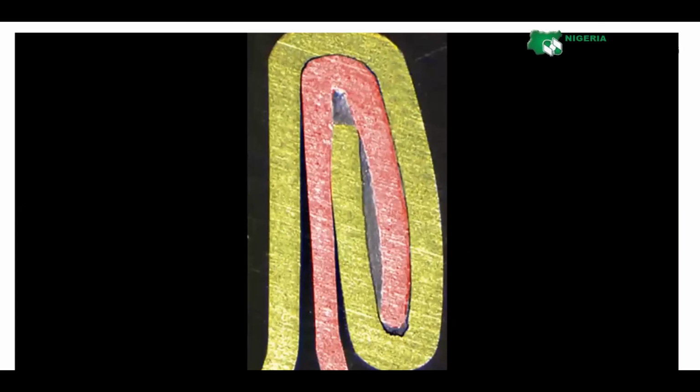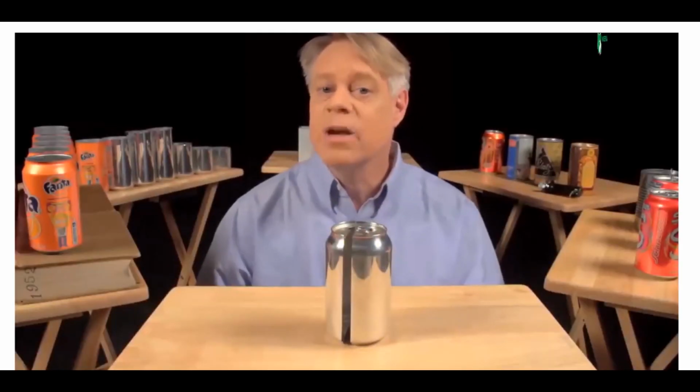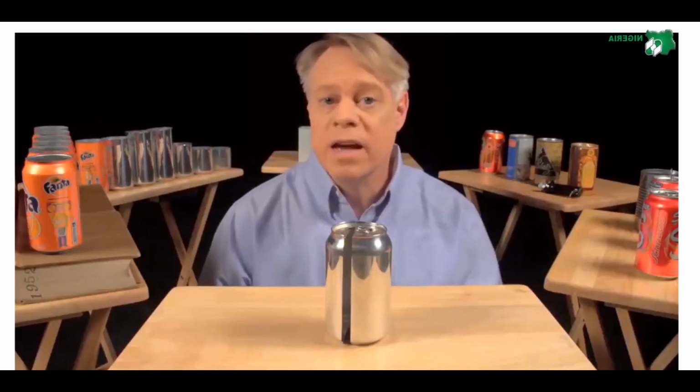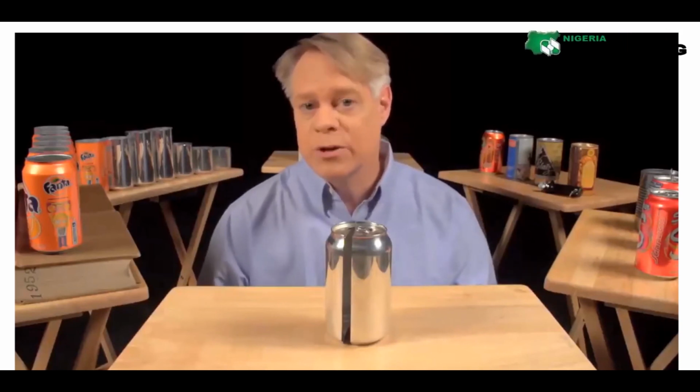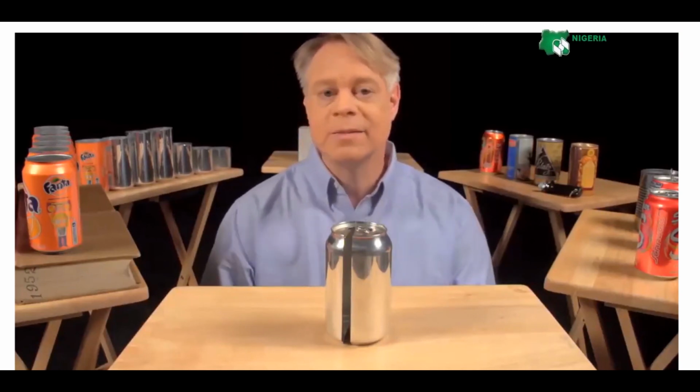In addition to the clamping of the end and can body, a sealing compound ensures that no gas escapes through the double seam. The compound is applied as a liquid and hardens to form a gasket. The end, attached immediately after the can is filled, traps gases inside the can to create pressures of about 30 psi or 2 times atmospheric pressure. In soda, carbon dioxide produces the pressure. In non-carbonated drinks like juices, nitrogen is added.